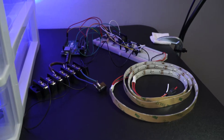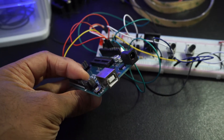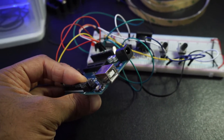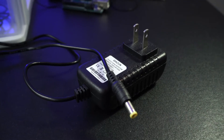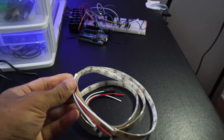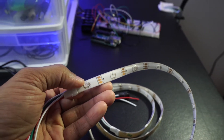I had to re-set up the system from last time. The biggest change is I was powering all the LEDs off the USB power, which has a limit of 500 milliamps. The LEDs, if I plan to light up a whole strip, will take a lot more than that, so I can't rely on USB power anymore. I'll be using an AC adapter that can go up to 3 amps, which means it could power up to 60 LEDs at full brightness, as each LED draws 50 milliamps. I also got a new LED strip — this one is 30 LEDs per meter, whereas the one I was using before was 60 LEDs per meter.